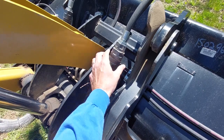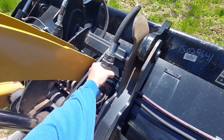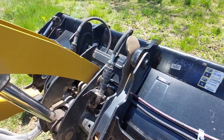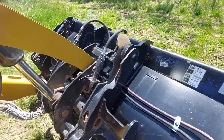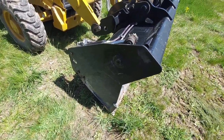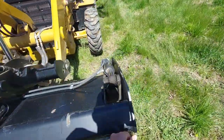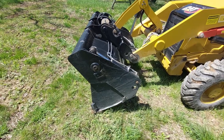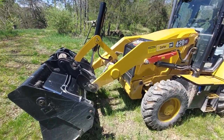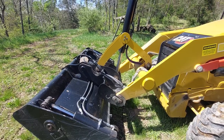CAT has done another cool thing — they came up with their own quick-connect hydraulic line. Instead of a push or pull depression type, you just grab it, twist it with your hand, and it pops off. Twist it back on hand tight — that's it. I get the four-in-one bucket on all my machines, and this one is super heavy duty. I actually had to get the bigger size bucket because the standard size wasn't available when I bought it, so it's a little wider than what the 420 would usually have, but it hasn't affected anything negatively.